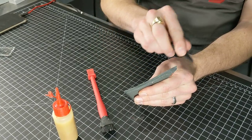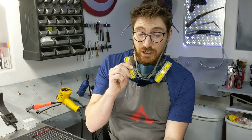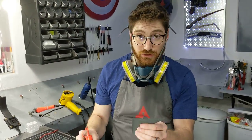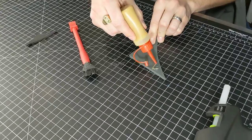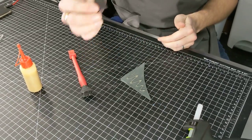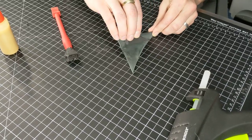You don't need it to go on thick. Spread it nice and thin — that helps it dry faster. A thin coat helps it dry faster so you're not waiting forever for it to set up. It also helps get a better bond with two thin layers of contact cement. You'd apply a thin layer to the other piece, and once they're set up, stick them together. Especially for edge-to-edge and small surfaces, this is phenomenal. Even on a wide surface, you do a criss-crossing motion and then drag a larger piece of scrap foam across nice and smooth.